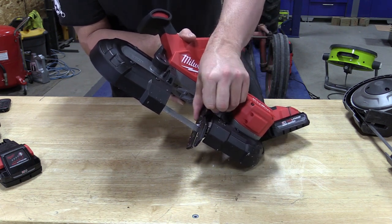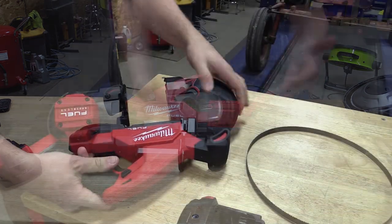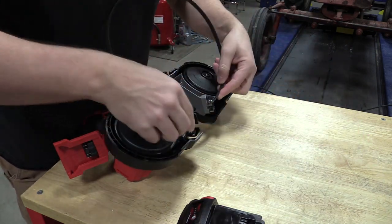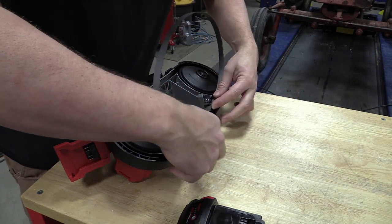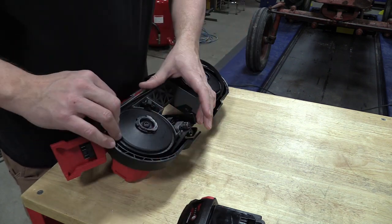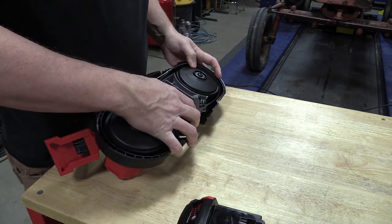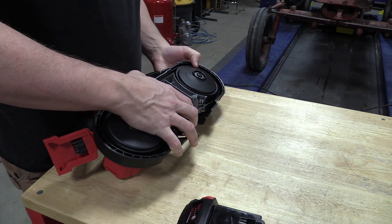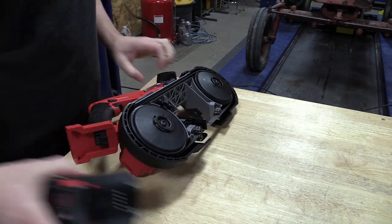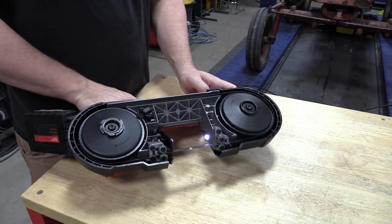Another change is the material guide, which is easily adjusted by pushing in one catch — it's got three positions and works awesome. Changing the blade is simple: you have a one-lever tool-free tensioner knob. It's easy to get the blade in and out. The drive wheels are set up well for controlling where the blade rides, though there are some small adjustments available.